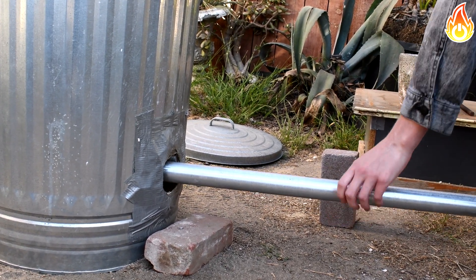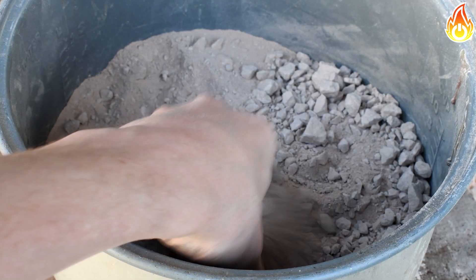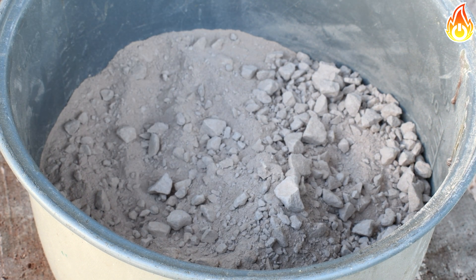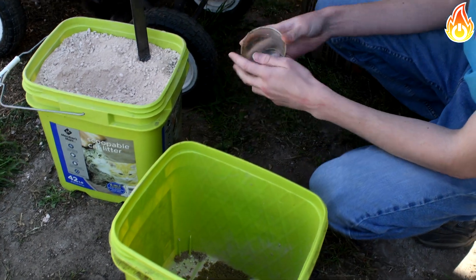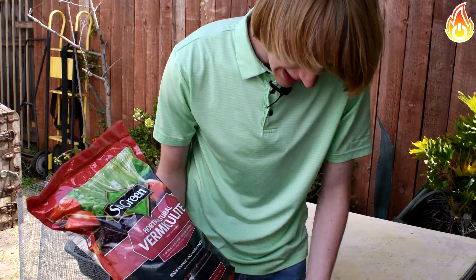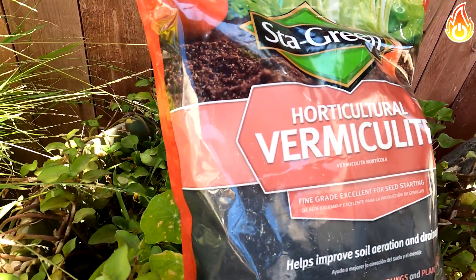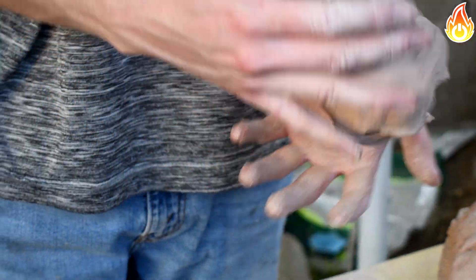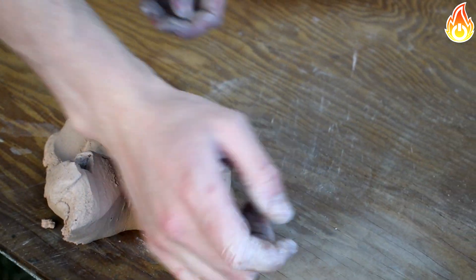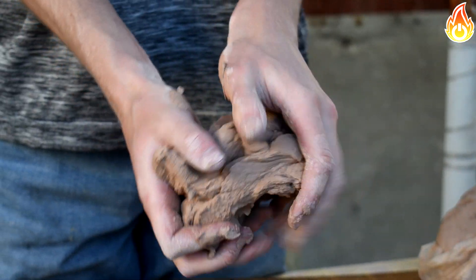The materials in my furnace lining are sand and clay — pretty cheap and readily available. A 50-pound bag of clay costs $9 at my nearest clay shop and can make multiple linings. Clay by itself would crack, so we add sand to stop that. For insulation I chose vermiculite, which can withstand temperatures above 2,000°F. You can get giant bags for $30–$40. The clay must be stoneware, not earthenware — earthenware cannot withstand the temperature and will melt.